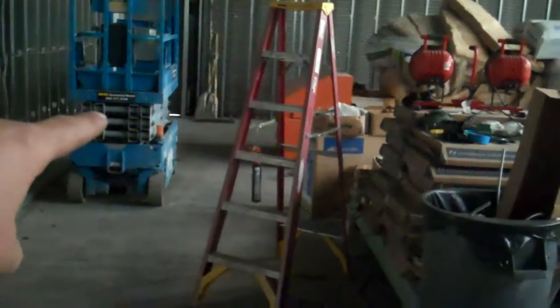We've got the ADA bathroom coming out of the bathroom, with a little closet to the left. New storefront location right here — I think we should put the counter where this scissor lift is right now, so I'm just going to put an outlet there and plan on that being the counter. The reason we want to do the design center here is because of this trench that's already cut in. Since this is being inspected, I've got to run PVC pipe underground and over into the island area for the computers and the Cat 5. This is set up for a refrigerator here, a microwave here, and then there's a switch to run — I'm going to put eyebrow can lighting into the grid to enhance the kitchen cabinetry.